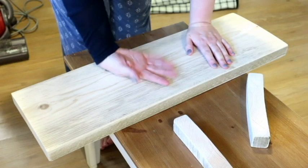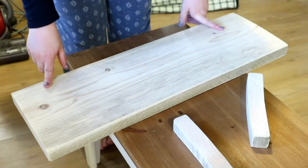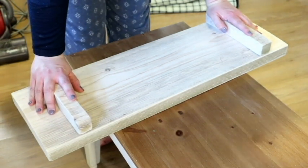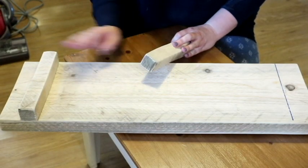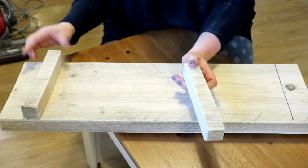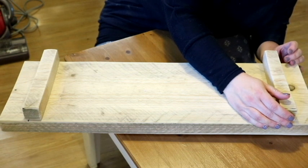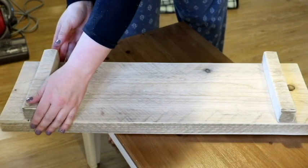I'm going to take this back upstairs and re-mark those lines, because of course I didn't think ahead and they've obviously gone — I've sanded them out. So I need to re-mark those lines, then stick the wood where I need to stick them, clamp them down, and wait for that to dry. So here is my board. I've marked those two lines and I'm just going to stick these little blocks just to the inside of those lines, give or take half a mil. I don't want them too far in, but I need to make sure this definitely fits once these are glued.